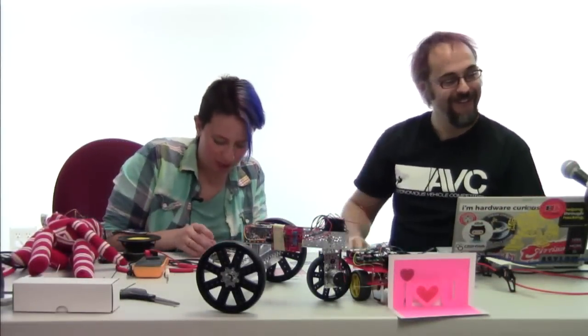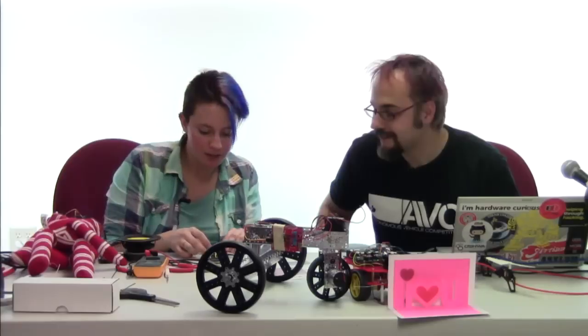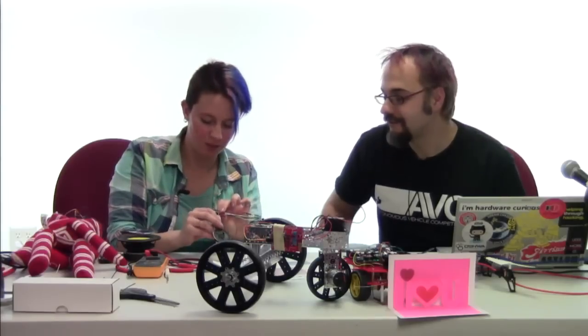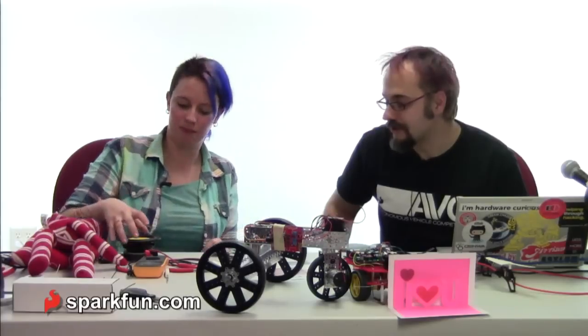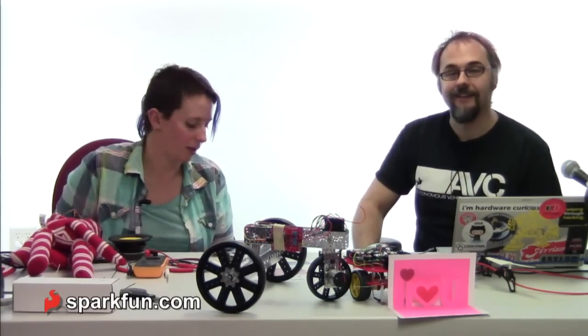So basically what we're going to have to do on this is a little bit of rework. It's going to be cutting those wires and just rerunning them. That's the nice thing about having this prototyping space. We can always do that. We can also cheat a little bit by using the internal pull-up resistors and changing the code a little bit, kind of on the fly here. If you want to do that, we could do that as well. Might be fun to show people.